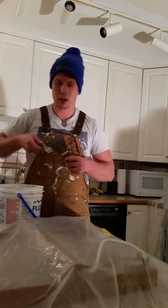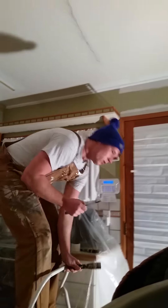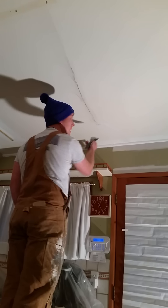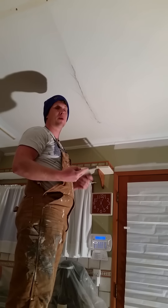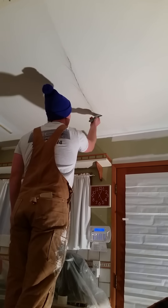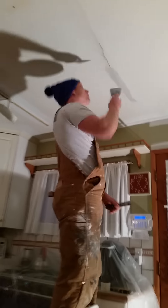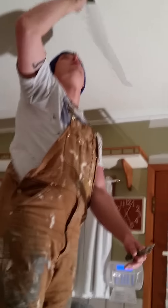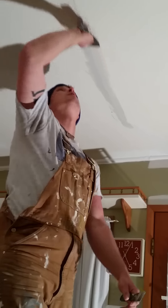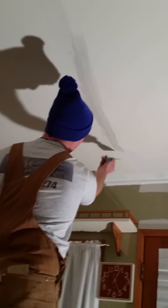Take a little bit of joint compound. This is going to be what we call in painting a skim coat — so it's not going to be anything thick. You're going to be making multiple passes of spackle on this, anywhere from three to five, to continue to feather this out. Always hold your spackle blade flush to the ceiling.